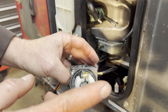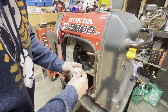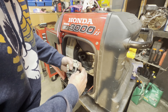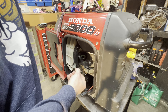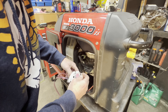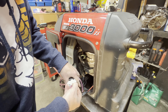All right, we need to see — can we buy a rebuild kit that has this plastic piece, or do we need a whole new carburetor for this unit? A couple of days later, the new carburetor is here. We're going to disconnect the wire, hook this up, install it, put some oil in it, and hopefully we have a good running generator.